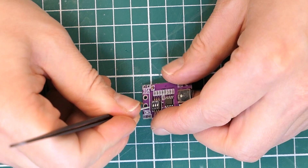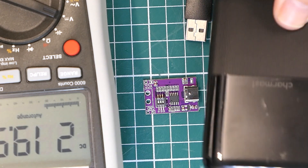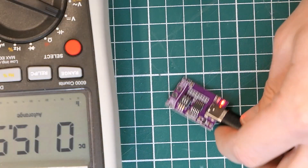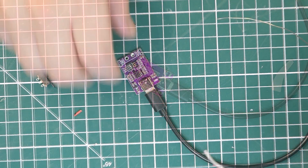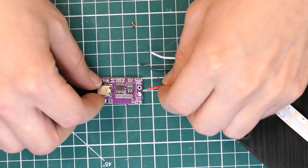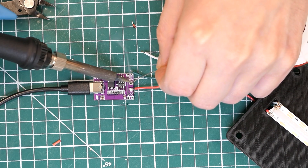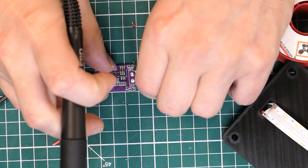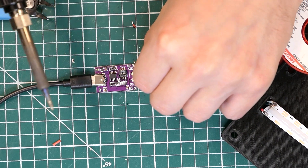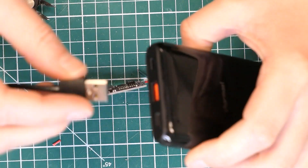I'm switching them all in the opposite direction and testing with a multimeter. I've got a USB battery pack - plug that in, plug it into the board, the board lights up. That's perfectly adequate for powering my light strip as USB-C can do a few amps. Now I'm connecting the LED strip to this power delivery board: the red wire goes to VCC (five volts out), the white wire which is the ground wire goes to the ground terminal, and I'm not connecting the green data line just yet.